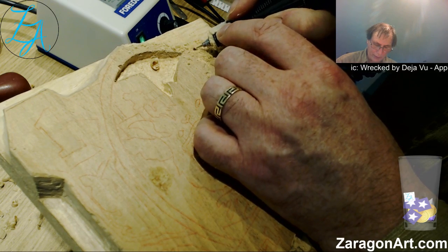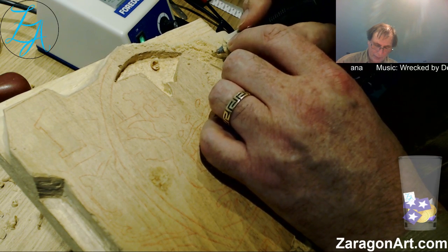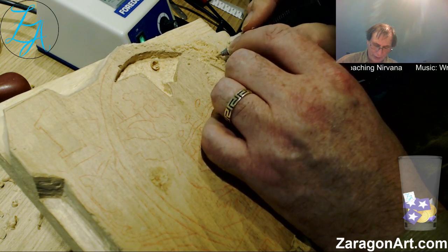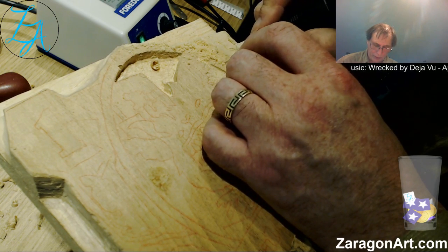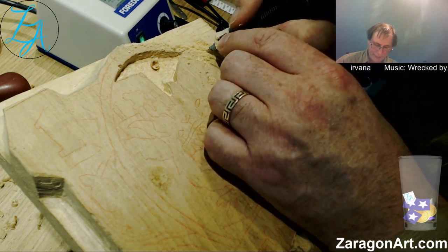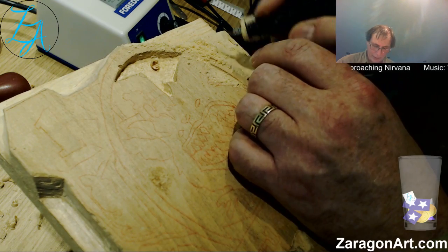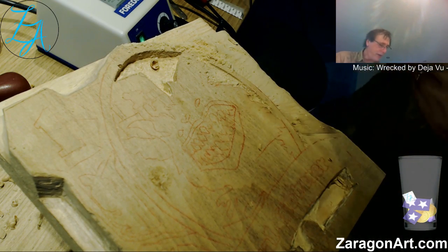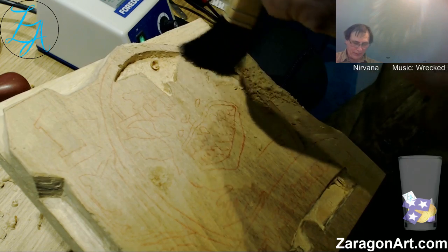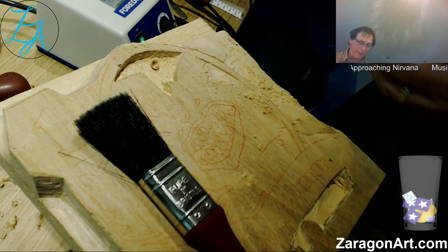If you're buying a compressor for rotary air tools, one of the things you have to bear in mind is something called duty cycle. How long in an hour, or how long is it allowed to run for before you have to let it cool down? And for how long do you have to let it cool down? You cannot run most compressors continuously. They overheat and seize. A lot of compressors have what they call a 3-to-1 cycle. So you run it for 1 minute and then you leave it 3 minutes to cool before you run it again.